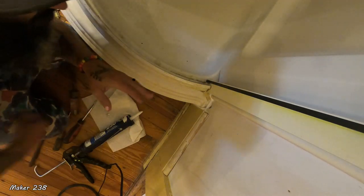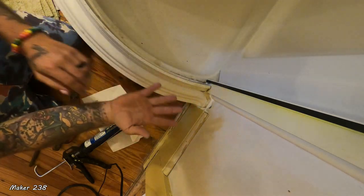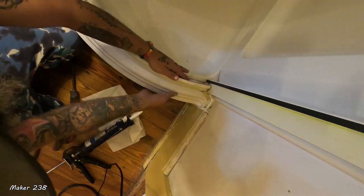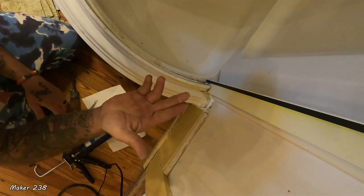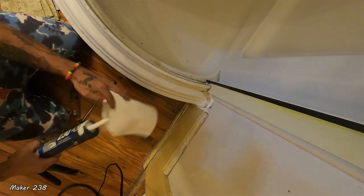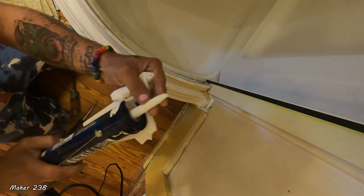So he would tell me, you got five different sizes right here. Use that in any given crevice, crack, anything. You got five different ones to choose from. So use those, and just lick it before you do it. Give it a little lick, and that way it smooths out your tooling. When you go to buy these things, they give you little indicating lines on here where to cut.